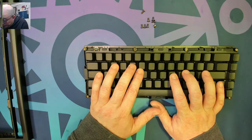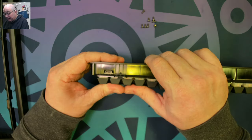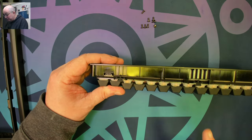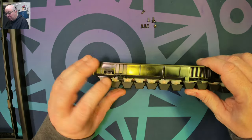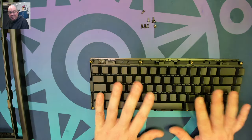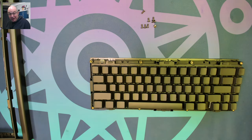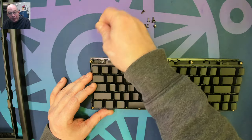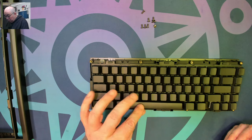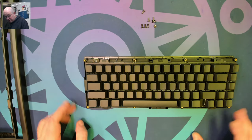Now, the gaskets do have some pretty good flex on there, but again, whether you're going down or coming back up against the case, I see that as an issue. I feel that we're going to be seeing a lot of these keyboards with broken USB ports, because while solder is there to make a connection, solder is not really strong. It's not meant to hold anything that's going to be taking any pressure. Besides just the pressure of plugging a USB cable in and out, it really isn't meant for any sort of pressure. I'm just not at all impressed.